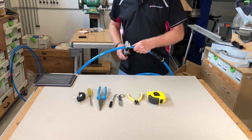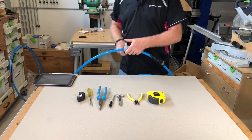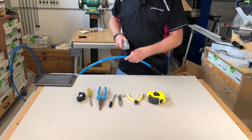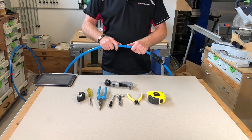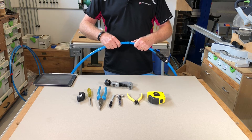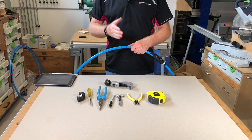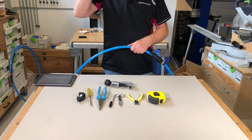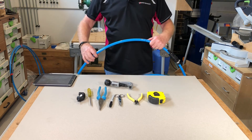There's one crack and there's the other. I'll take the cutter off and I can just check that the strength members have gone — I can flex the cable. So that's as far as you want to go. You don't want to go too far; you don't want this cutter to go into the core of the cable and destroy the fibres. So that's all we need to do.